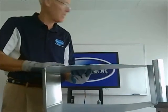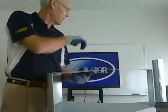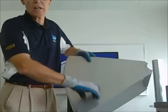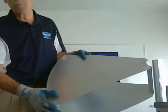Some people call this the easy way and the hard way, because if you've ever made one, this is a very easy elbow to make, and that is a very difficult elbow to make. But whenever you see the air travel in the horizontal dimension, that's called a flatway elbow, or some people call it a Broadway elbow too.